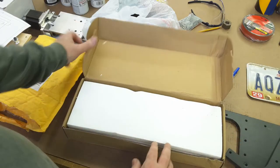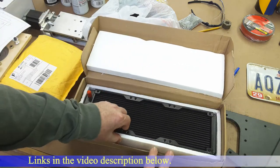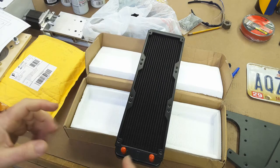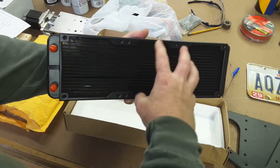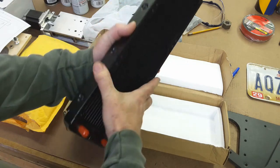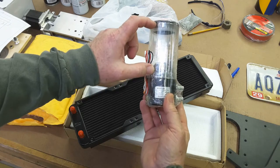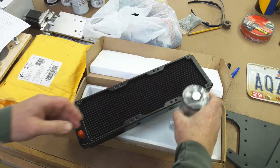I put the idea into motion — first thing I did was go onto eBay and look at water-cooled computer systems. There were some closed-loop deals where the coolant was already in them, but they were all fairly pricey. Then I ran across this: just a small radiator designed to hold three fans, where you can add whatever components you want. I started with this as the base, then found this little unit which is a water reservoir with a pump below it, with 12-volt power in and out.